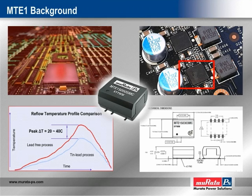Moisture absorption and retention can be a major issue for many surface-mount devices with lesser MSL ratings, as large stresses can be generated when the part is subjected to a rapid and very large temperature rise, such as during lead-free reflow processing. The resulting rapid release of trapped moisture, once vaporized by the reflow heating, can easily destroy devices with explosive force. An MSL-1 rating means no expensive handling and storage precautions are necessary to avert such catastrophic failures.